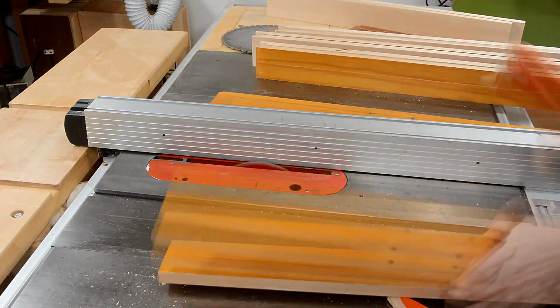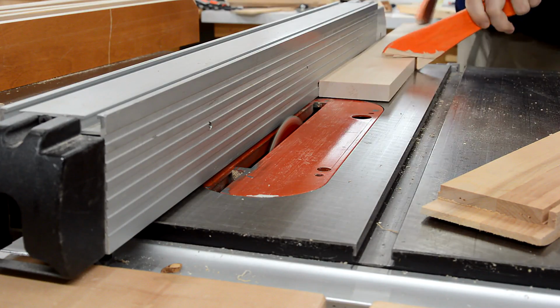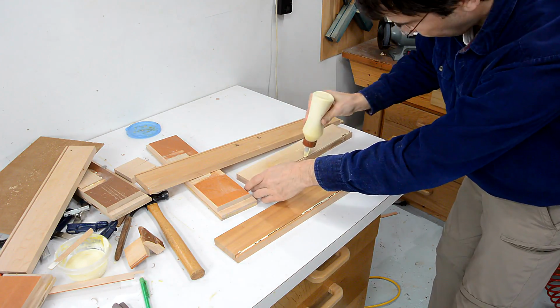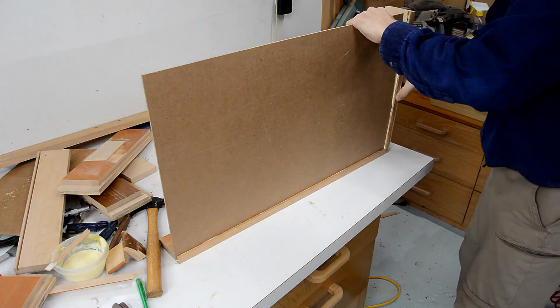And now cutting slots in the sides for the bottoms to fit in. The bottoms were going to go flat against the bottom of the side pieces, but I changed my mind. I'm gluing the hardboard on all edges. This will help stiffen it up, and with the hardboard I don't really have to worry about shrinkage and expansion.